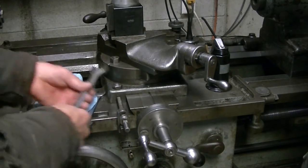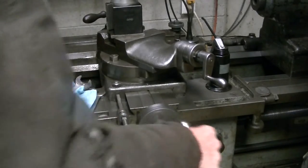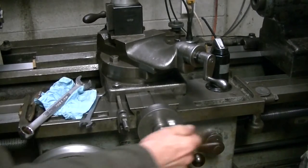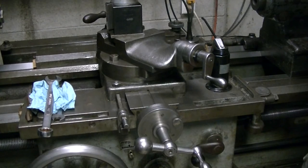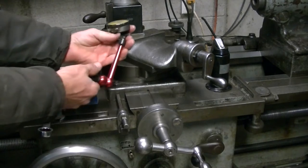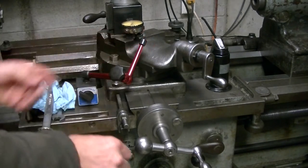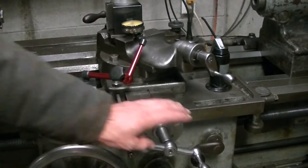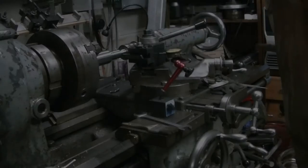Right here I'm setting the cross feed locking rod. The rod comes out, it's got a little hook that swings up and locks it, so you can go back to your zero position with the cross slide without having to look at the gauge. I usually zero it just in case, but you don't have to look at it. And then, as per Keith Fenner, I started using the dashboard gauge, as he calls it, for the compound so you can see your actual feed depth.